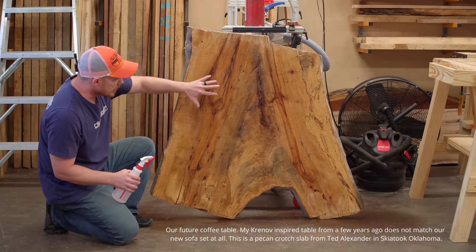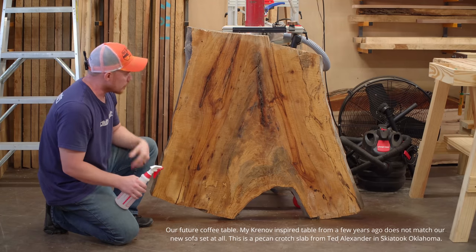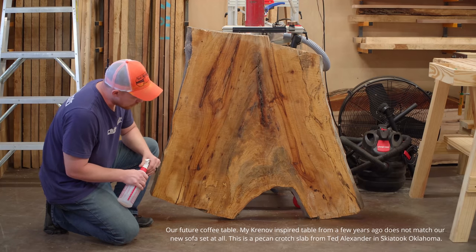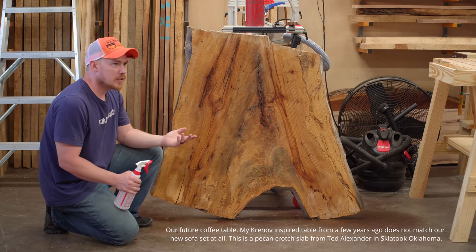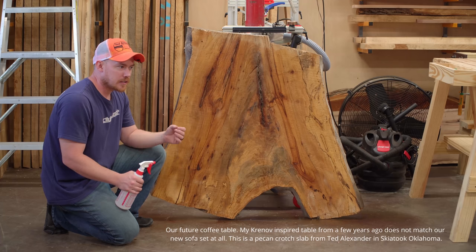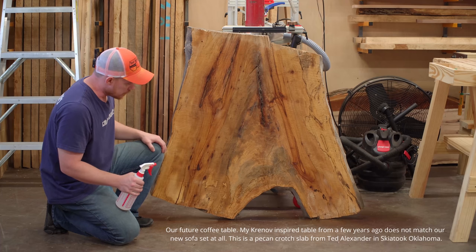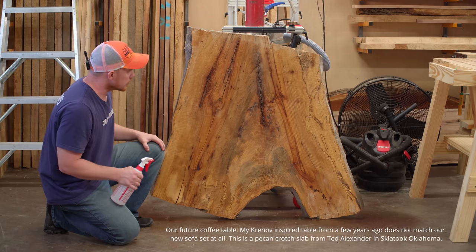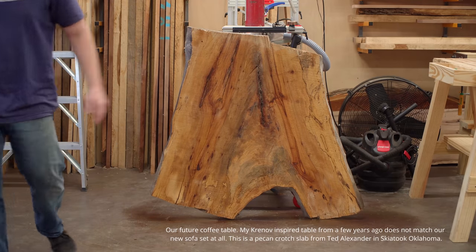It'll be focused on the wood, using the epoxy as a stabilizer rather than the epoxy being an accent or a focal point. Some of these epoxy tables get a little crazy. I just don't see how there won't be long-term issues with expansion and contraction with wood in an epoxy table. I don't know. Maybe there's some that are out there for long-term. It just doesn't seem right locking a piece of wood together with epoxy, on a large scale, anyway.